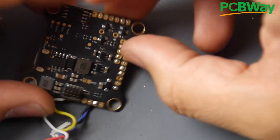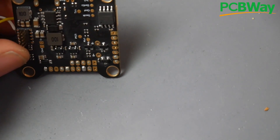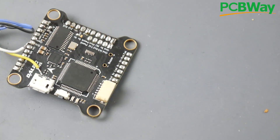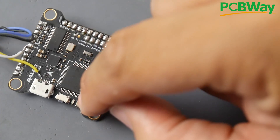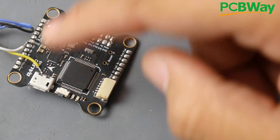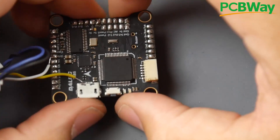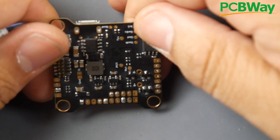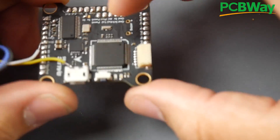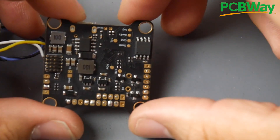So we confirmed a bad Schottky diode — these are the ones that usually burn out on most flight controllers. However, if you had a short on the 3.3-volt regulator, it's scarier — it could be the regulator, the MCU, rarely the gyro, or even a resistor or capacitor. If you plug in a flight controller and get very dim LEDs, that indicates a short on the 3.3-volt rail. The components on flight controllers are minimal — once you know what each IC does, debugging becomes straightforward.